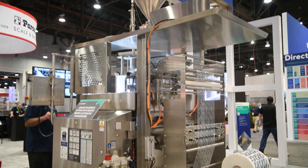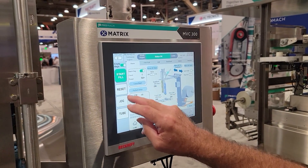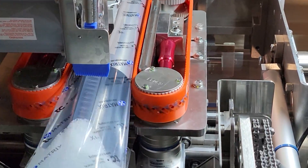There's a lot of similar technology to what we have in our other equipment, but the big differentiating factor is there's a squeegee system that controls the volume of liquid being pumped into the bag while also taking air out of it. The pump is running continuously where we can be a little bit more accurate and get that headspace out of the bag.